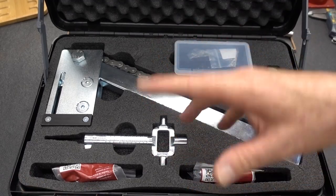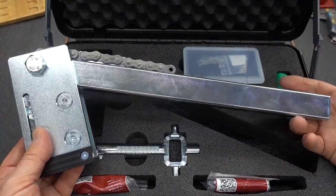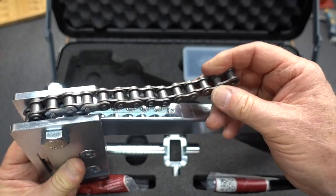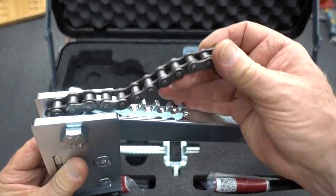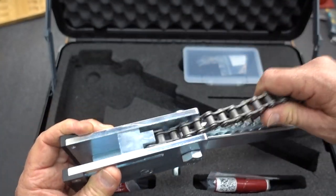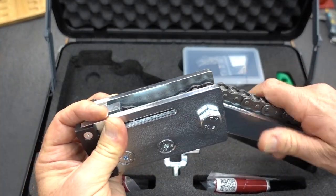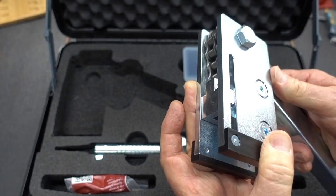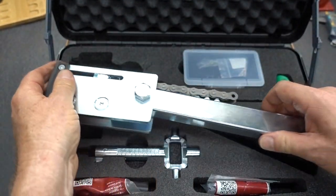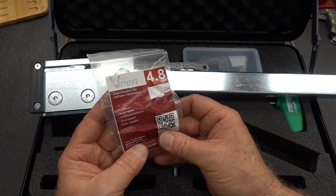With a little bit of practice driving the screw and so forth. Here's what the tool looks like — you can see it's based on a fulcrum, a lever, and it has what looks like the chain from Arnold Schwarzenegger's bicycle. This is like 10 times normal size chain, very heavy duty. When you lift this up you can see that dude slides — slide him forward, hook him up in the sprocket. And when you pry this thing back, you can see it will extract. You need something to go into there, and what we're going to use will be these Viper extraction screws.